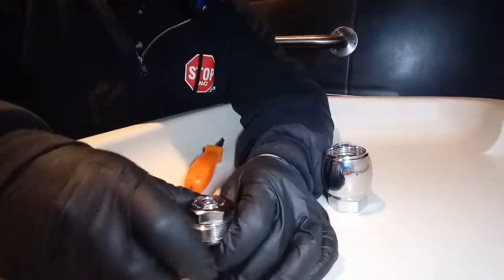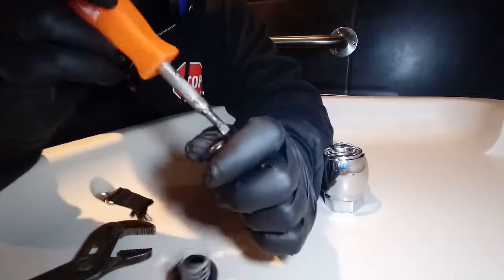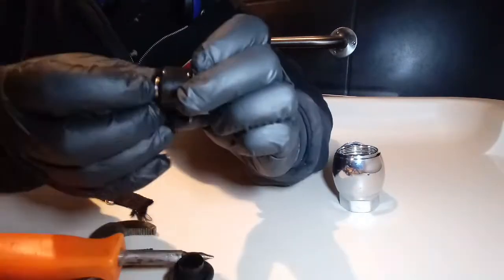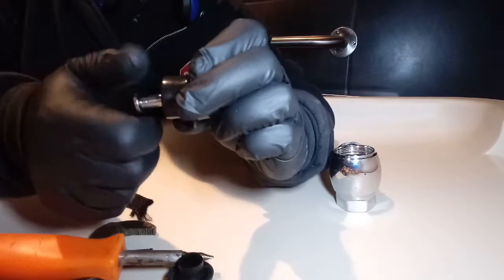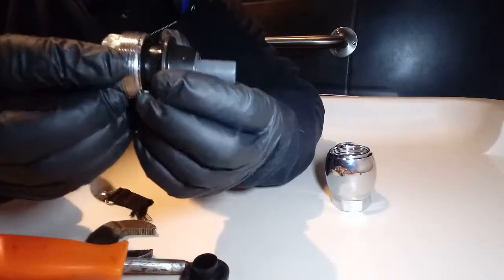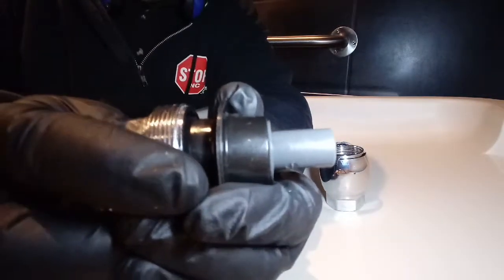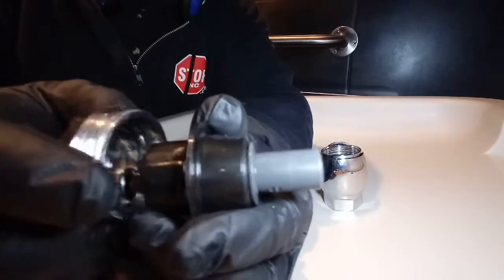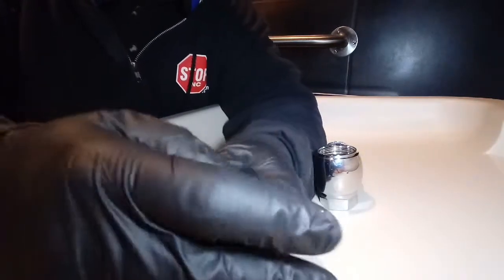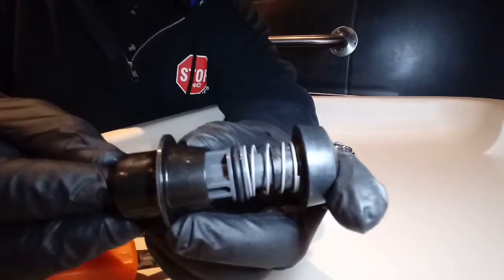So what it does is this screw is reverse threaded. When you go to tighten it, you notice it comes out. And the reason why is it's actually sitting here like this, and normally that screw wouldn't come out. What it would do is it would push through, and you'll notice this gray plastic comes out. That in return pushes our plunger into a surface and, of course, makes it so that it won't allow water past.